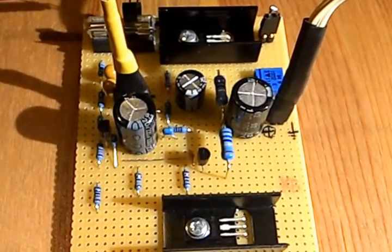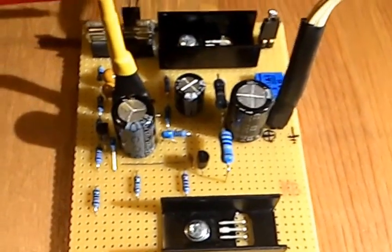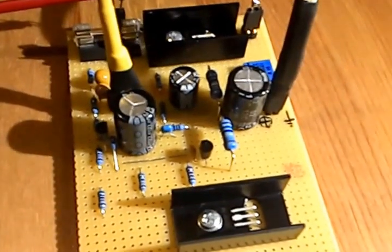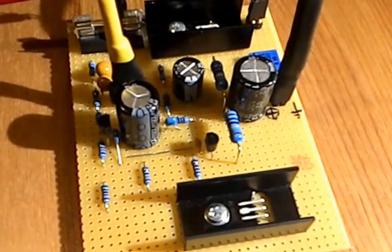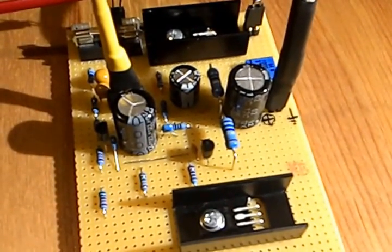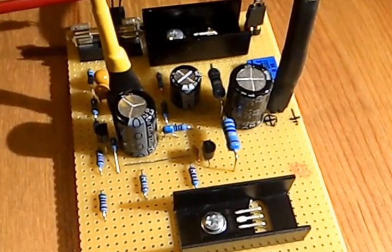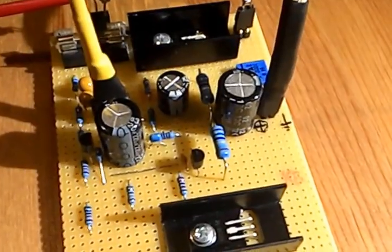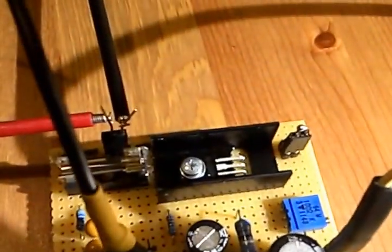What I've tested is over a few minutes this little song from Jake, and the transistors were working quite cool. Jake, you maybe recognize your video. So maybe there's no thermal protection needed. The thermal protection in this concept is done by an NTC resistor. So a resistor with a negative temperature coefficient, and this has to be placed then on one of the transistors